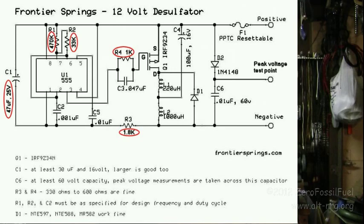Putting the diode and filter capacitor, D2 and C6, on the circuit board with the electronics really is not the best place to put it, because you are still seeing voltage spikes in the higher frequency ranges that do not appear across the terminals simply because of the interconnecting wire used to attach it to the battery. So when I take my spike measurements, I actually measure those spikes directly at the battery terminals.